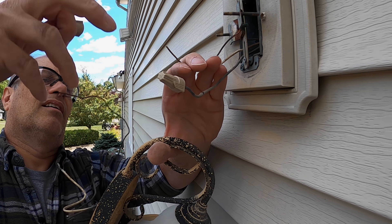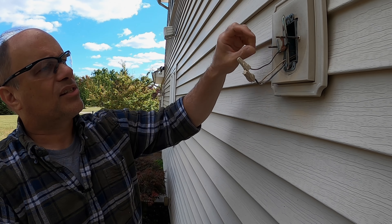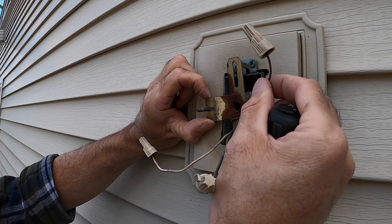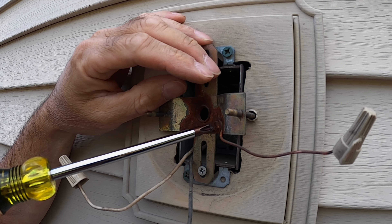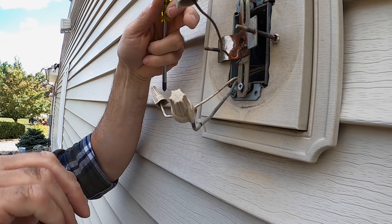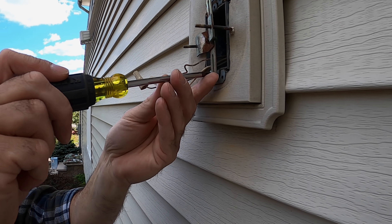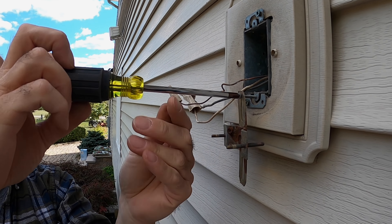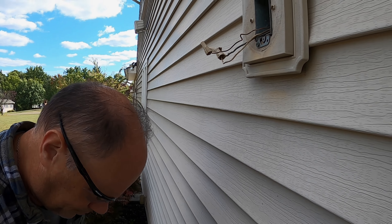The second scenario: if the broken shards are coming down, you can take the little bit of wire off and stick a potato up on there, which will grab onto the broken shards and let you unscrew the socket. The third scenario is when that bulb has been in there so long it's oxidized against the shell — sometimes aluminum shell and aluminum socket oxidize right together and you can't get it out. You have to use needle nose pliers, get up on the aluminum shell and keep tearing the shell all the way around, force it in, then easily unscrew it. But in this case I'm fortunate I can just take out the socket, and that's an aluminum socket and aluminum shell that became one piece.